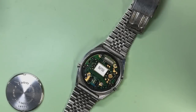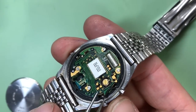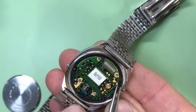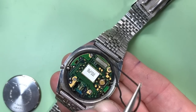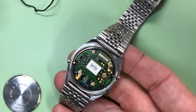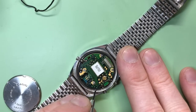To remove the module, I've noticed we've got a case seal or gasket and it's actually coming away - either someone fitted the wrong size or it's grown. Sometimes they do that. It's very old and I can feel the rubber is quite hard; we will replace that as it's going to be no good. Then get a screwdriver and find somewhere safe to pry.